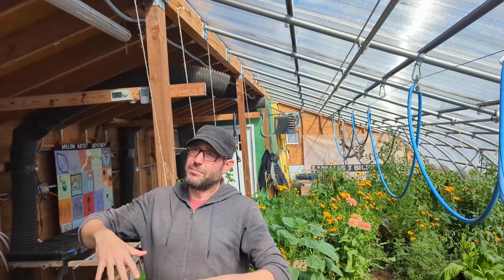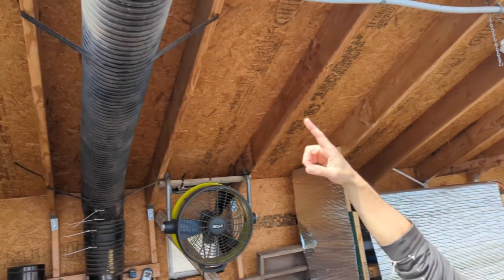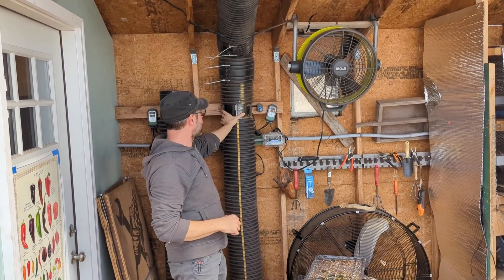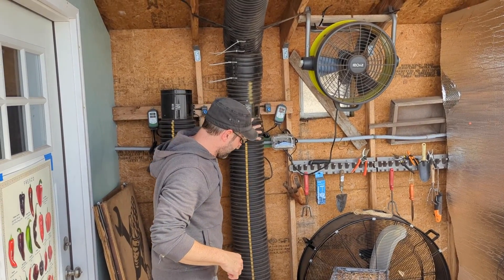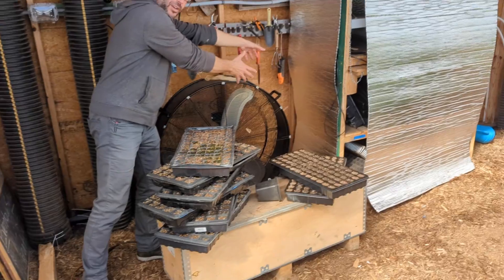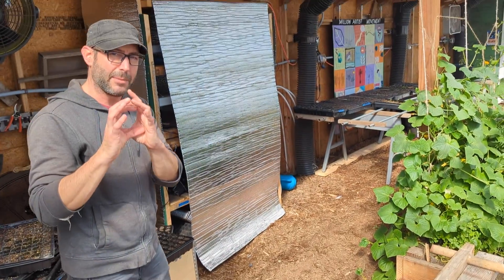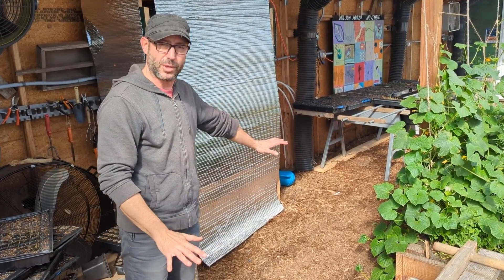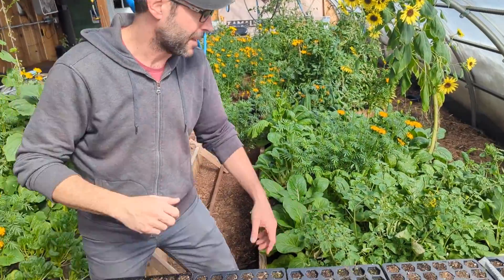The sun's heat comes inside here, rises up to the top of the space and then goes into each of these black ducts. This is the intake of one of them — the hot air is drawn down this tube through these inline fans right here. This fan is attached to a speed controller and a temperature controller. That pushes it down into a large manifold that goes buried in the ground on the north side of the greenhouse, and then off of that manifold is a series of three inch diameter transit ducts. Those are spaced about a foot apart, about eight inches to a foot underneath the surface of the soil. All that time the warm air is basically transferring its heat through the pipes into the soil underneath us.